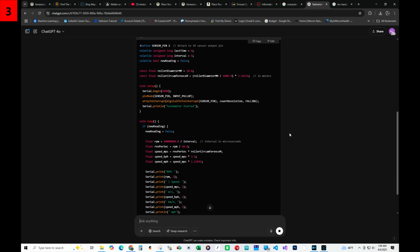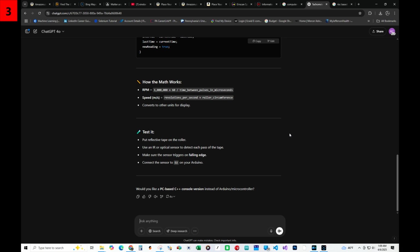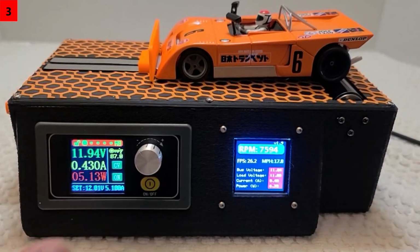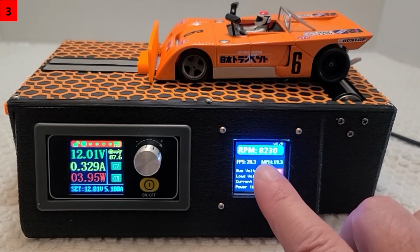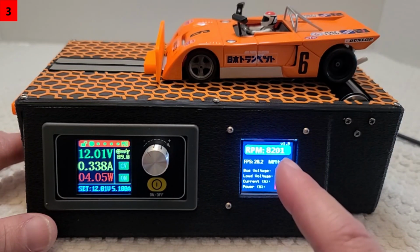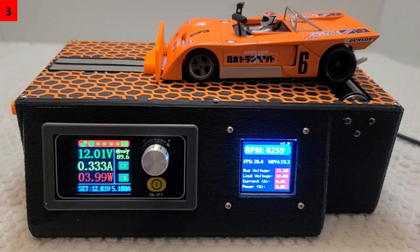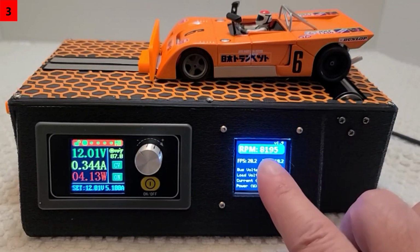The software includes an algorithm that adjusts the sensor sample rate to maintain accuracy across the entire RPM range based on the current speed of your car. So what that basically means is the TechBench checks to see how fast the last sensor reading was and adjusts its sample rate based upon processor load and how hard it's working to display and send output to the screen and serial port. It does these calculations and adjustments on the fly, so it continues to take accurate readings while still giving you quick responses back, with all critical calculations being performed inside the code's interrupt loop, not the main loop. This is key to the TechBench's ability to provide accurate readings quickly.